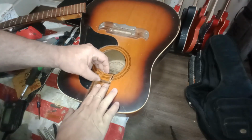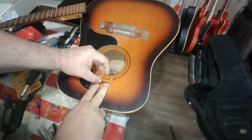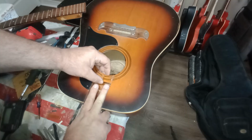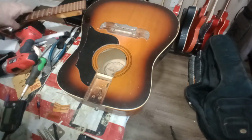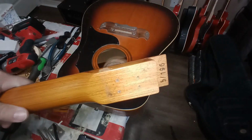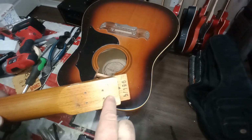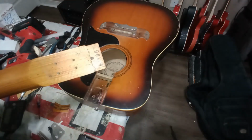Well, the neck had curved up because it had given right in here, and this was pushing. So the only way to fix it would be, we're going to have to scab something also up underneath it to bring the neck to tilt back right. These holes right here, that's factory holes, the only holes that have been drilled in it, are in the wrong place. So as the neck pulls out, these are going to be 3/8 off. But I'm going to re-drill it all the way through with these big giant long screws.